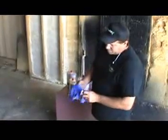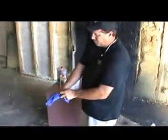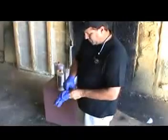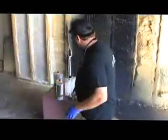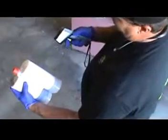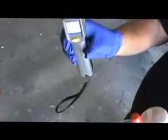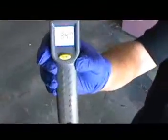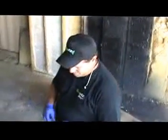I'm going to spray two different densities of foam — I'm going to spray the half pound foam and the 1.5 pound closed cell foam. I'm going to put my gloves on here. Before you spray, you want to make sure that the cartridge is the proper temperature. Shoot that with a little infrared thermometer — it should be about 84 degrees right there. Very important: make sure you wear safety gloves and make sure you wear your respirator.